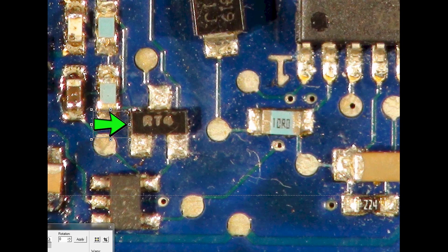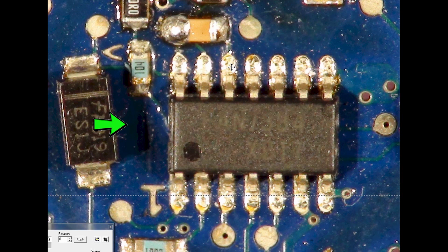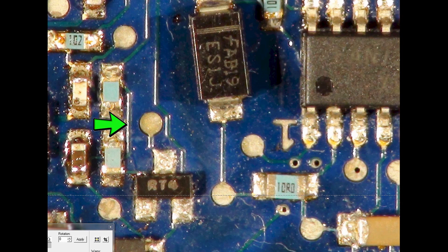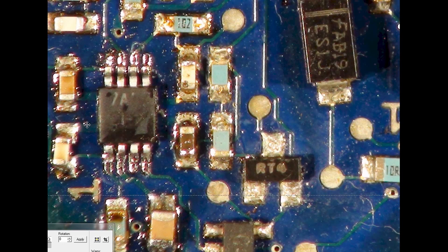What happens is: voltage comes in through the gate drive circuitry from a shorted FET - it could be up to 300 volts - and this destroys the PNP transistor. That then feeds back through the power rail into the VCC, destroying this device and then the LM5021 as well.